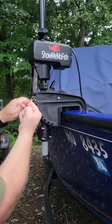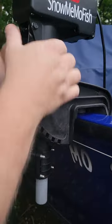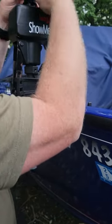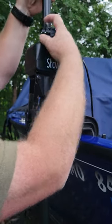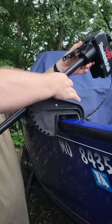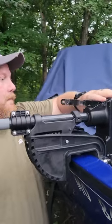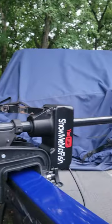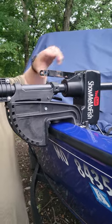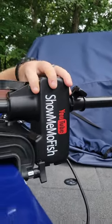Second option: I put this clevis in here. Simply pull this out, set that to the side. You've got to loosen the clamp and let the pole down a little, then pull this up and bring it in the boat. So the motor isn't sliding around — simply pull your collar back down, push the rod up, tighten it, and nothing's going to go anywhere driving around.